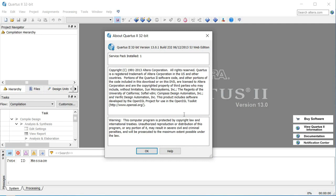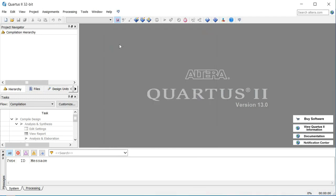I don't know if you can still download this — I think they've taken it down off the website. However, there are still some places you can scrounge it up from. The reason you want to use this particular version is because it is one of the last versions that supports both the Cyclone 2 as well as the MAX 7000 series — and as we mentioned, we are going to be using the MAX 7000 series CPLD for this project. Specifically the EPM 7128 84-pin PLCC.